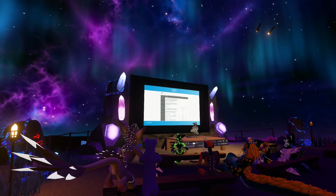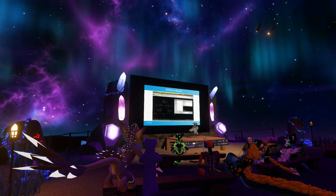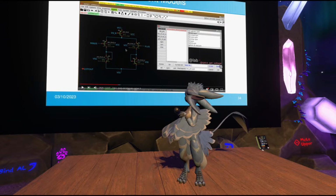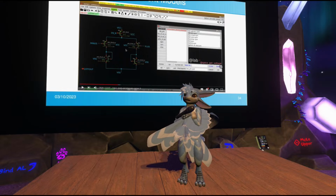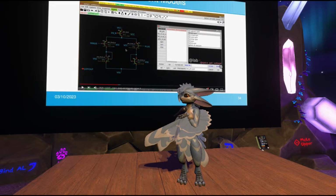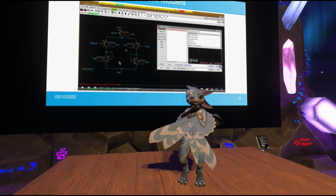I also need different simulation models. I couldn't find a better screenshot of the software for some reason, and I couldn't get it to run. But this is a software called XSCHEM, which is being used to help with analog design with the SkyWater 130 PDK. You can see a very simple circuit there with some transistors. And this tool is capable of simulating your analog designs in great detail. It can even factor in the temperature of the physical chip when running the simulations. And so you really need very complex models to make that happen. Those, of course, are included with the PDK as well.